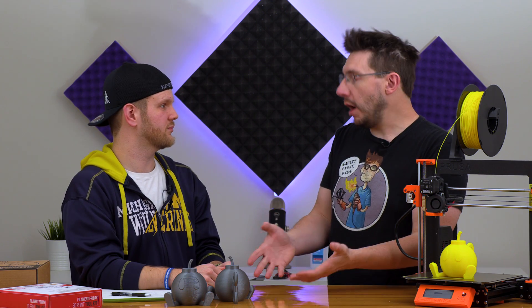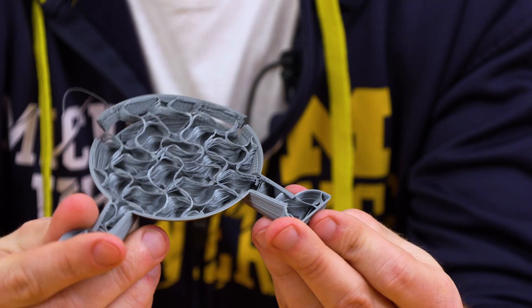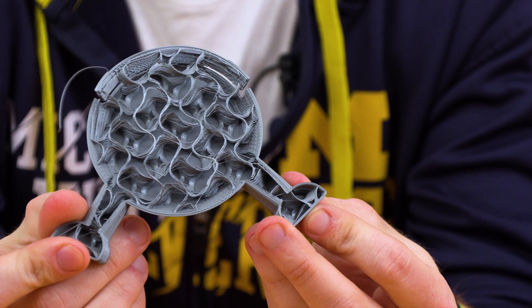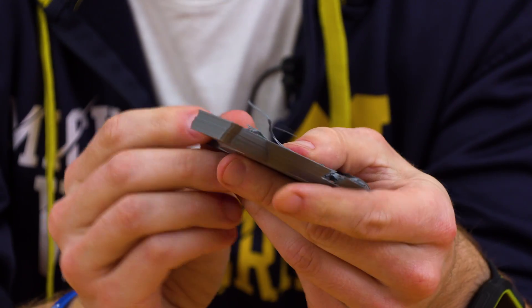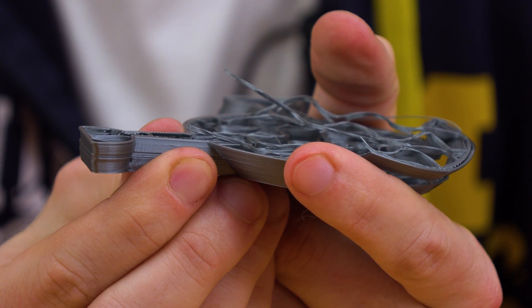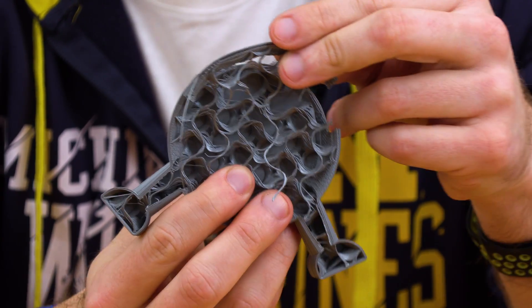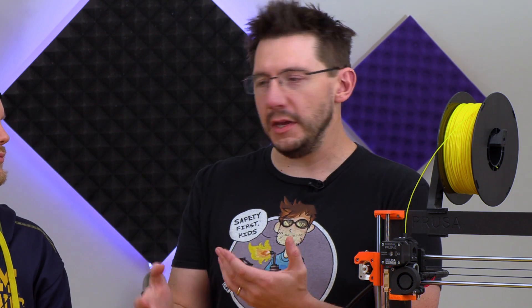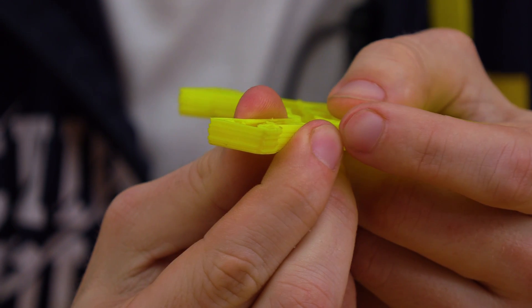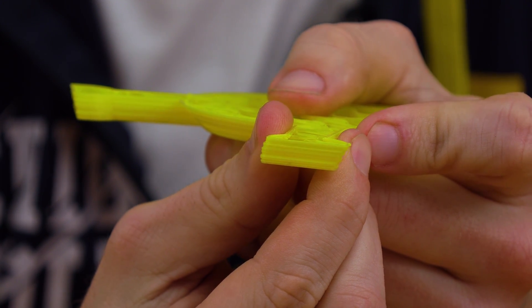Now that we'd proved the nozzle was an issue, we reprinted the Bob-omb — and it wasn't so great. You could easily see layer shifts right through the model, and we noticed that pretty much immediately, only about 10–15 minutes into the print. We thought maybe it was bad filament not extruding correctly, so we tried another filament. Same exact issue — shifts in very similar spots, maybe even more. So it was definitely not the filament.